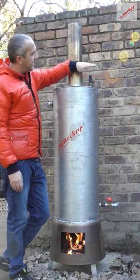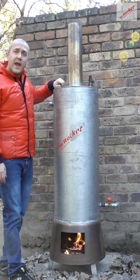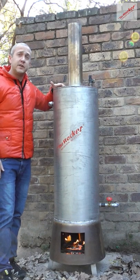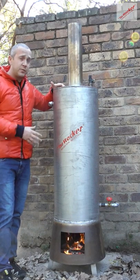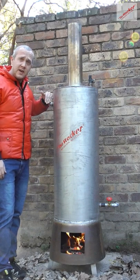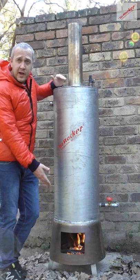We have a SABS approved safety valve here, which we recommend. We have a sacrificial anode here — if you have any water quality issues, it will take away all the corrosion. And finally, we have hot water out at the top. Obviously we've got a fire going, a small little fire with a few small wood pieces.